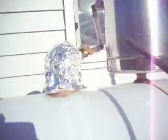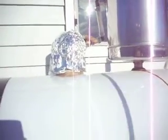We use this model in the summertime. If you'll notice up here on the cold supply coming in, I've teed it off. This is an expansion fill tank. There's a stainless steel float in here, and it'll fill it up and maintain this level. As you can see, it's getting hot, so it's expanding and it's coming out.